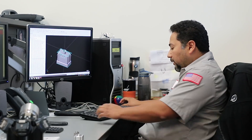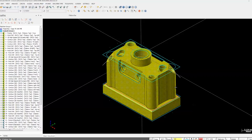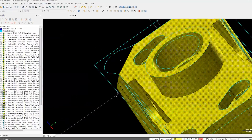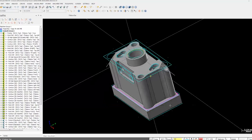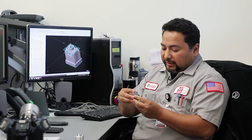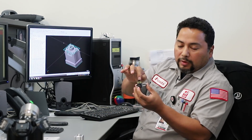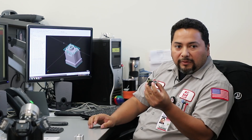So do you have your XYZ zero at the center and top of the part? This right here is my second operation — the most complicated, because this is where we're working with all sides of the part. In this case I have my work offset right on top of the part, right on center of my material. So I don't need to worry about the trunnion or the dovetail. If you're more concerned about clearances, you would model all of that. If the tools had to be really stubby to get in there, my biggest concern would be my tool holder hitting the bolt.